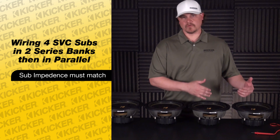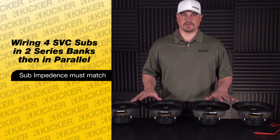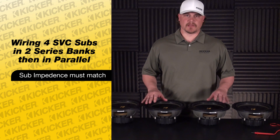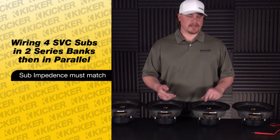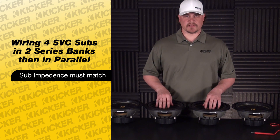Never include a 2 or an 8 or mixed ohm loads within your batch. Always make sure that everything starts out the same. If you have an odd speaker in there, it could change the final output to an amp, and the lower ohm load tends to pull more current draw from a setup.